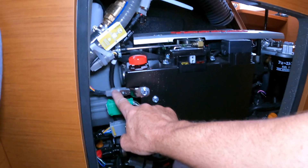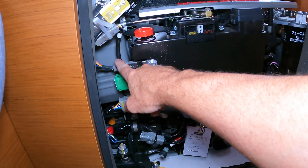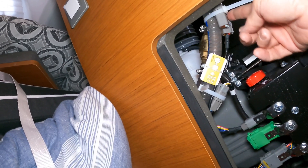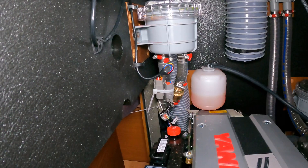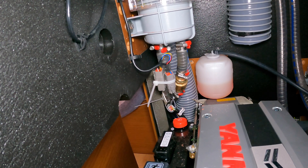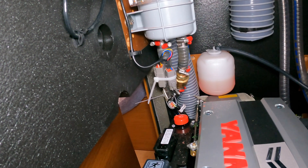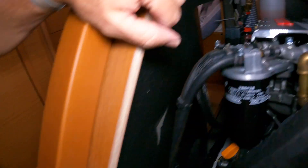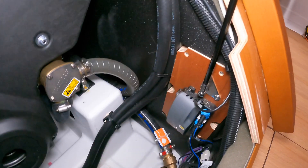It turns out this install wasn't that bad. I'm in the aft cabin here — we've got an access port to the engine. This is where the ECU is, the brains. This was where the lead was coming off going to the display up in the cockpit. What I did was I just wired it in. There was an adapter that wired into the Yacht Devices, with wires going up. I just have the wire running up to the junction and then running along the backside, going into one of the SeaTalk buses here.